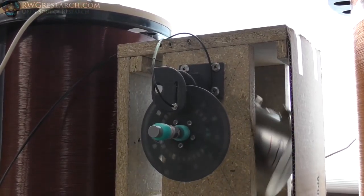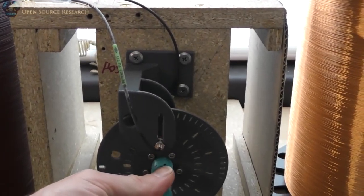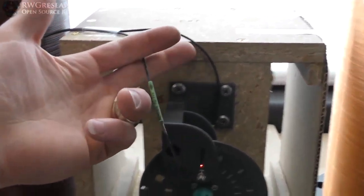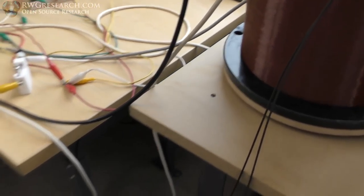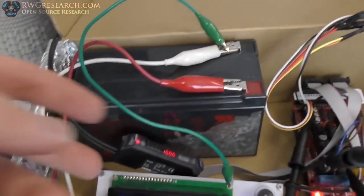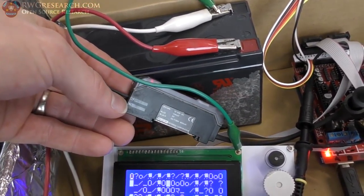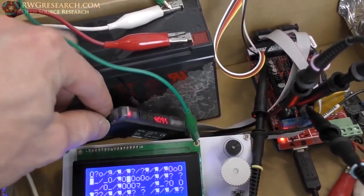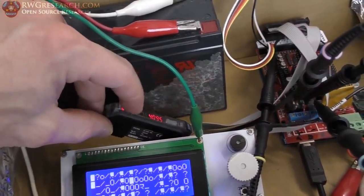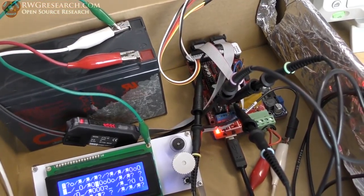So what this is actually, is a laser. Well, it's actually an LED probably. Could be a laser LED. I can't get too close, but you can see that there is light shining through there. These are two fiber optic lines, one for going out, one for going in. They run over here to this module. This module just picks up, sends and receives, as you can see on the side, and then puts out a signal, and then you can do a whole bunch of fancy stuff here. That feeds into the Arduino, and I'll show you what the Arduino program is doing on the other side.